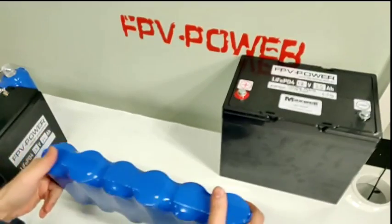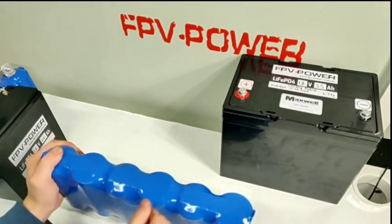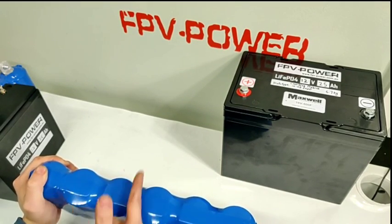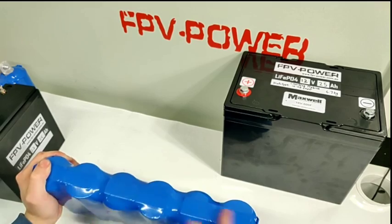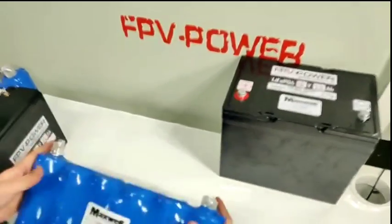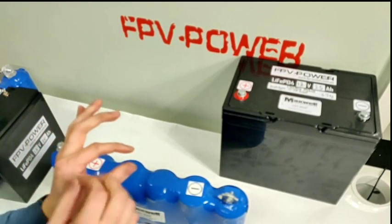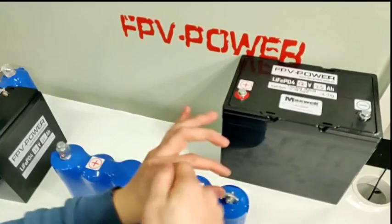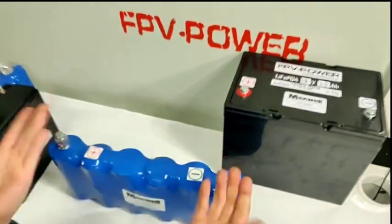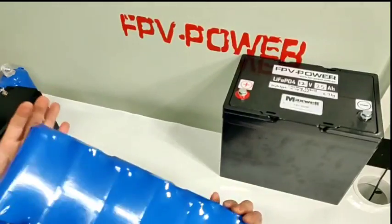And what we need to do is we need to TIG weld aluminium bus bars to connect these two. Because once you cut it, there's no room whatsoever to do anything. It's right there. Each cap is there. So we chop it, turn it around, and as you know, TIG welding, it's very, very hot, but we are quick with it. And basically, we just put a bus bar on, TIG weld it on both connections on the sides, so it's all nice and strong. And then we'll wrap it up into a PVC, and you get similar to this. I might even just insert a photo for reference.